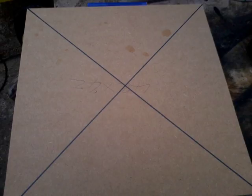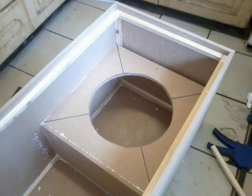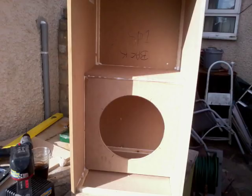You need to cut out the top panel of the boom box. In this case you need the inner dimensions for a 15 inch driver — don't forget that, the inner dimensions for the bolts. When you fit it, use the dowling as your porting slot for air to escape through the port. After you've fitted that front baffle panel in the base boom box, that's what it should look like. The bottom where the panel comes down to the dowling is just the right size for the air to escape out nice and fast, so you get a good bass response.